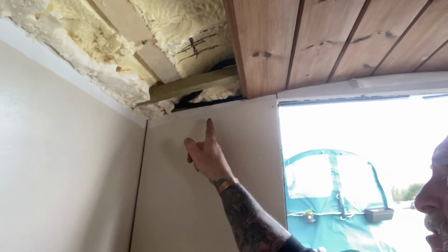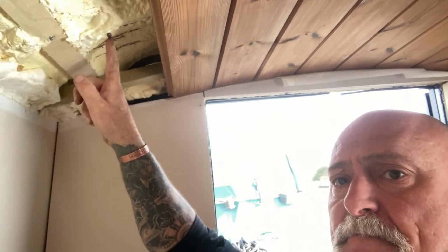Okay, I've just put some vertical lines down, some bits of wood really, to the collar. Plumb lines no good. They ain't going to work on a boat. Spirit level, they ain't going to work on a boat. So yeah, I've wired it up to where that's going to be, and sort of in the centre of this wall here. So what I'm going to do, I'm going to stick an exploratory drill through there, poke it out the ceiling, the roof, right out the top. I'm pretty sure it's okay, but that finds my centre then for cutting out, okay?